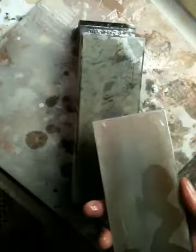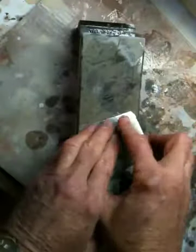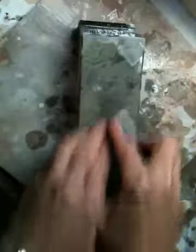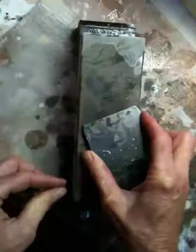I'll charge the stone with a worn-out Atoma plate in this area. This is just a very light slurry. I'm only using a small portion of the stone. There is a nice amount of dark, milky slurry going on. It's not an outrageous amount or darkness, but it's what I would expect from a good stone. There is some good darkness there, so I'm going to rinse off that blade and this stone.